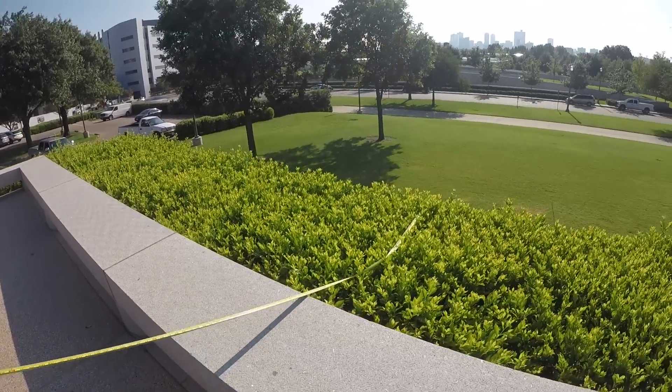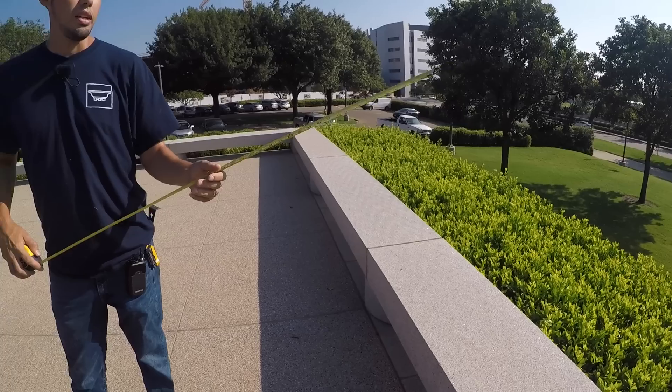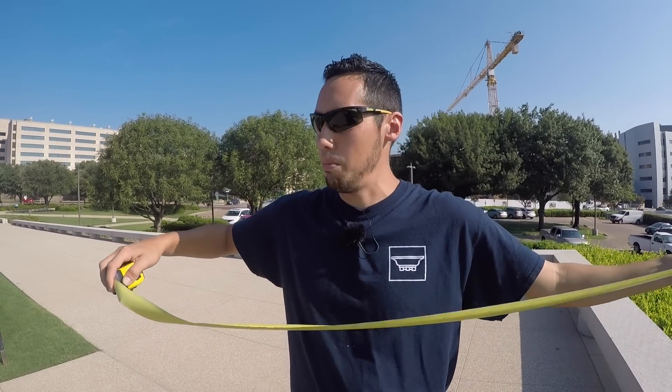That 11-foot standout is really good when you're trying to get an accurate measurement on crown molding and you don't want to bust out the laser tape measure. This is my go-to, and I use a 25 because I like the 16 when doing baseboard, but for crown molding where you've got longer runs the 25 is my favorite. Even a 16-foot tape measure won't quite get you 16 feet, and the 25 will go to about 24 and a half.